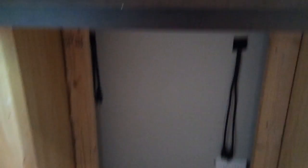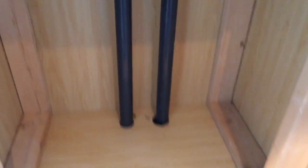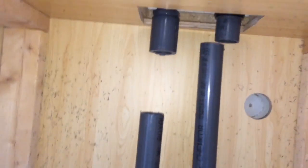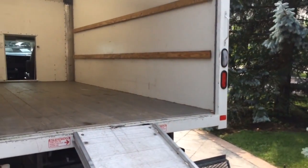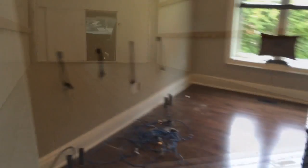There are 2 PVC pipes — one's 1 inch and the other one's 1 inch and a half. In the middle there's no plumbing, no PVC pipe at all. On the 3rd unit of the stand we also have 2 more plumbing pipes — PVC — which are 1 inch and another 1 inch and a half. Those are coming from our overflow boxes, which are acrylic overflow boxes. We have 2 drains at 1 inch and a half and 2 returns at 1 inch. This is a Eurobrace tank and it's looking phenomenal. We're going to get started here — cut the plumbing out so we can get the tank off the stand. I just got a skill saw and gave the plumbing a cut.